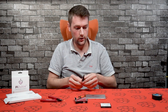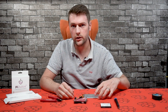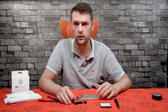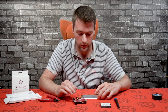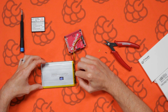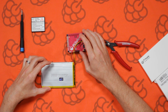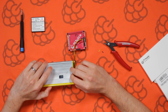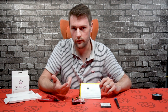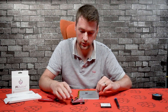That's the battery connected, so it's pretty much ready to go. But you do need to set up the battery profile in the PiJuice software. This sets up the charging for the battery and also various other things like the capacity of the battery, so when you check the battery status it will give you the correct percentage of battery remaining.